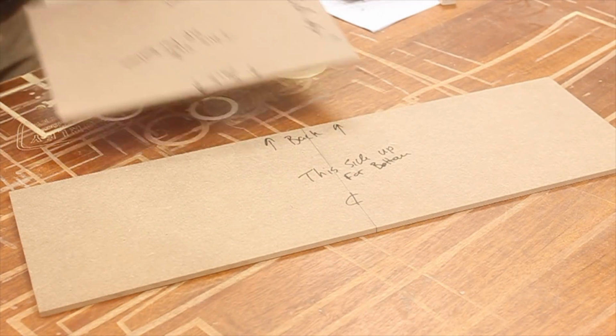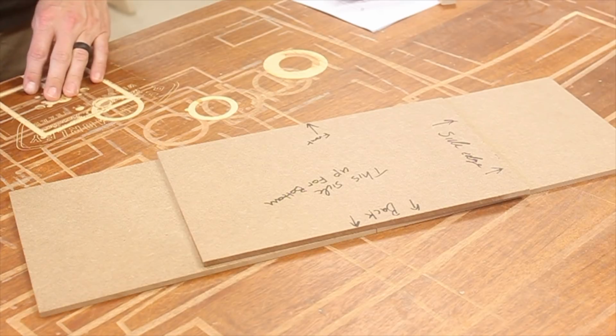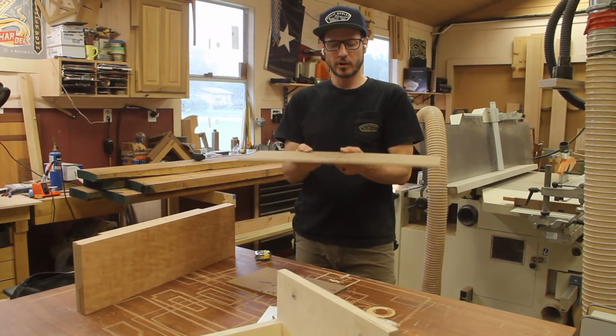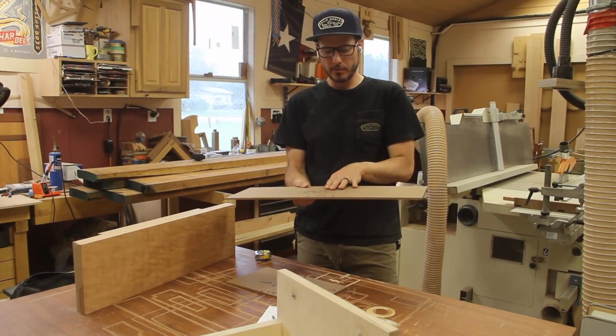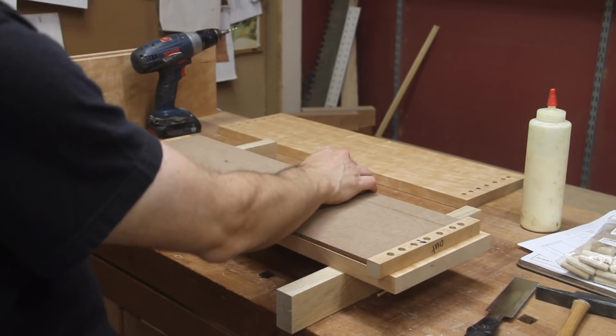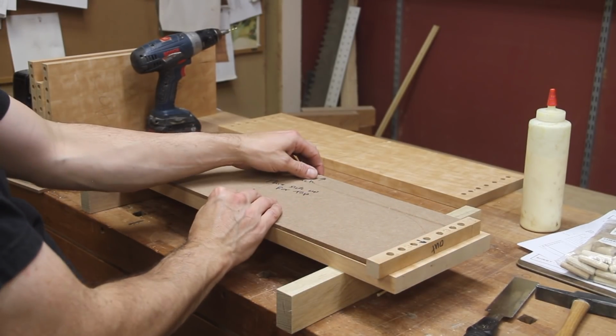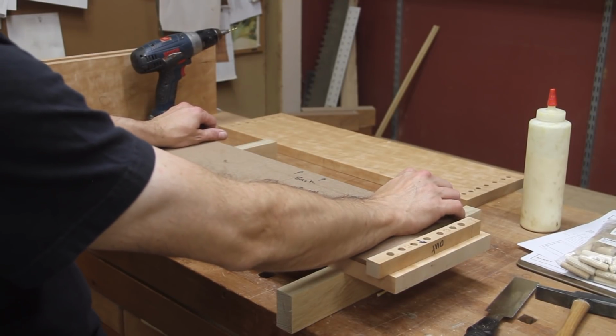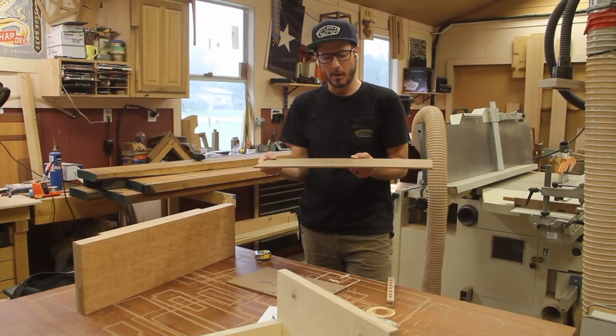Two more things: shims. So this shim is, let me measure, 23.5 inches. This will reference on our top and our bottom, and basically it sets this up, because that's where our divider is going to go. It's going to go there and over here. And this is really important: when you use the shim, have a perfect center line that corresponds to the center line on our parts.